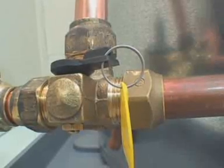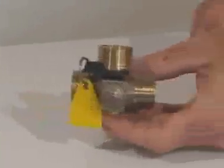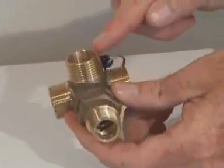The pressure reducing valve is designed to reduce the mains pressure supply to a low pressure hot water cylinder. The next valve in line is the cold water expansion valve. This is designed to relieve cold water as thermal expansion takes place during the heating process. The expansion valve incorporates a drain port and an additional port to connect a balanced supply to the tempering valve above.